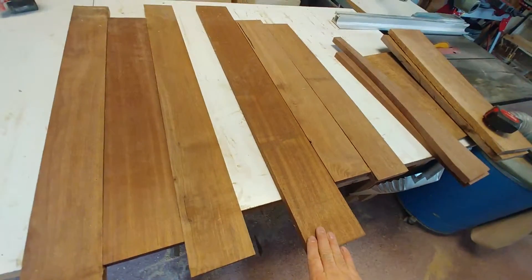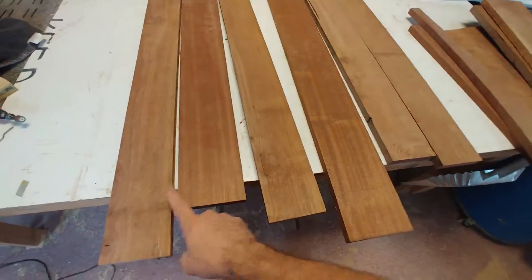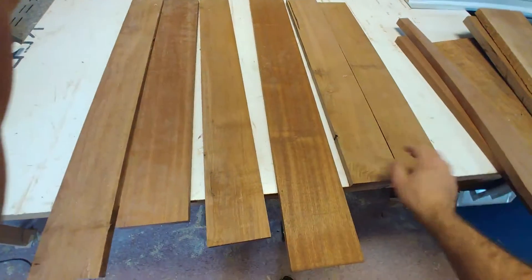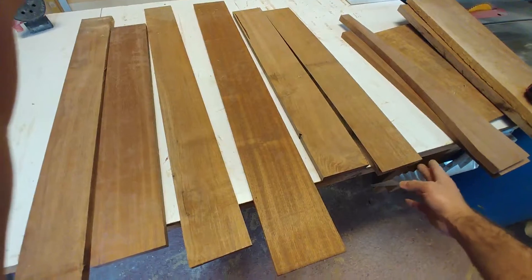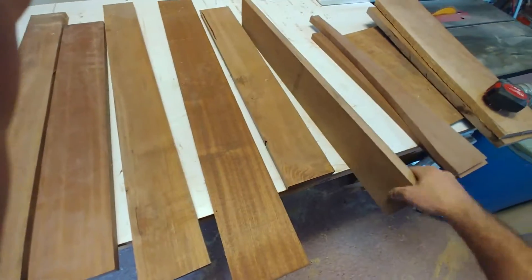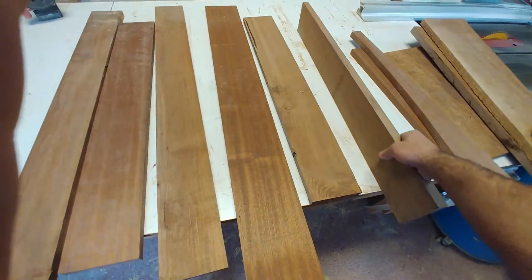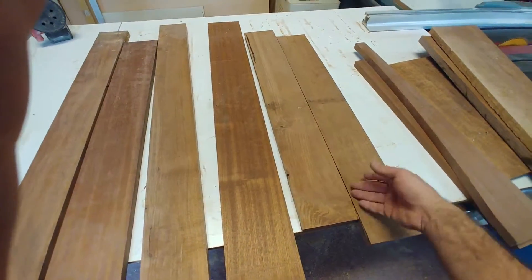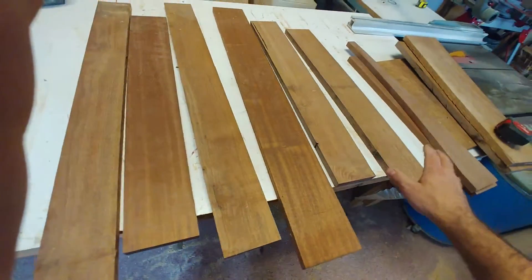I was able to find some other lumber. These two pieces were one piece of black walnut — I ripped them in half so they're more manageable. Now in cross-section they're kind of a trapezoid — not a true rectangle yet. They're gonna go through the jointer with the big aspect against the fence to put a 90-degree edge on both sides, because right now if you were to glue them up one side would sit open.